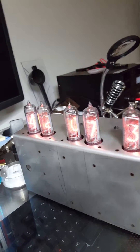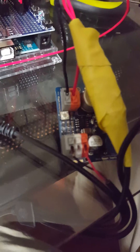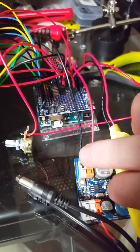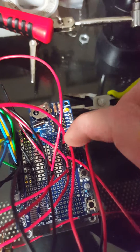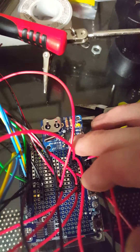I'm going to get it in mirrored aluminum and polish it up. So anyways, you've got your power supply coming up, and for the last step you've got to make another split off this cable. You've got these multiple female ends — I've had to split another one off. You can see right here I've got a second female head split off into the step-up chip, and then I've also got my original splice. The step-up chip wires are coming up and out, going into the ground row. I've got my positive coming off the step-up chip, and I've added a potentiometer or variable resistor between these two wires.